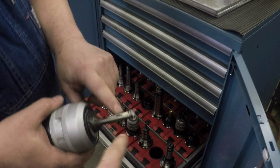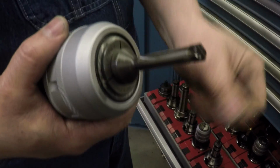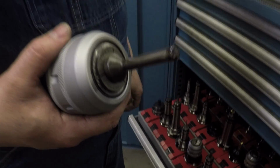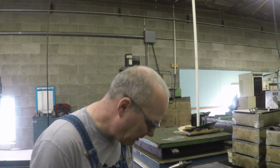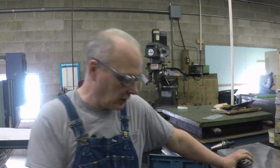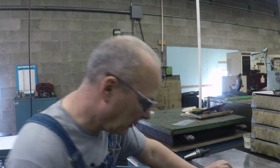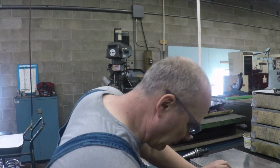That's interesting. That's a milling chuck holding a really small spade drill. That's a small spade drill that they sell. Why a spade drill there? Well, you don't have to run them as fast as a carbide. Of course, you can get carbide high-speed inserts. And that particular drill we're using in aluminum, so we didn't have to run it so fast. And it's through coolant. Oh, so this machine has through spindle coolant? Yeah, it's just through coolant spindle on this machine.